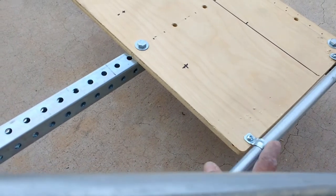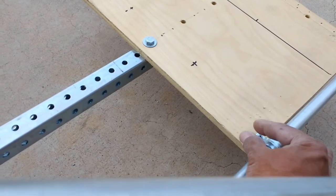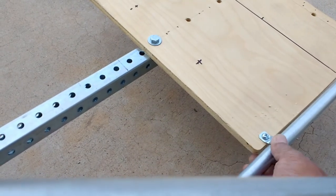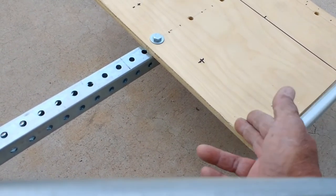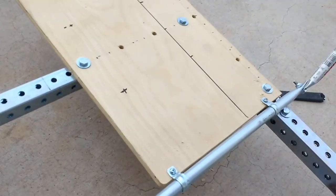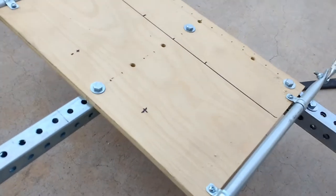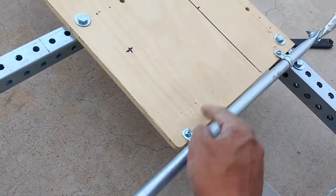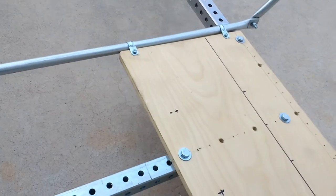They do make conduit straps that are copper, I think, and you can cut those to length, and they're perforated. Those will work very nicely here. You just have to wrap it, cut it, and drill the holes a little bit more inward to the seat. So I think I'm going to go that route because this really doesn't need that much support here. As long as you have four connections there, it'll be nice and solid.